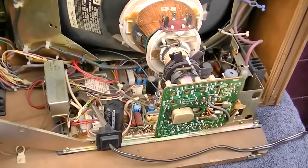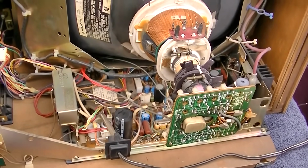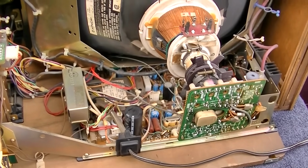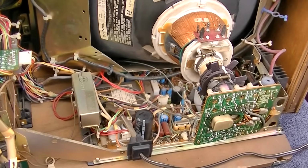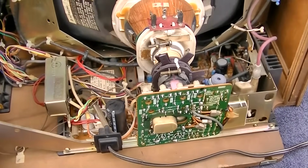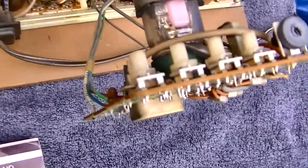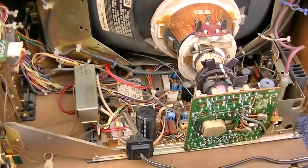It's a beautiful day here at the Vintage TV repair desk. So, as I thought, I had seen this issue before and actually had a video on it, and I'm hoping it's the same thing. I'm hoping for a quick fix. I also ran it by Radio TV Phononut, and he said, yes, most likely an open capacitor in the 200 volt B plus circuit that feeds the transistors right here on this little board. So I guess if you get the horizontal noise unfiltered from the flyback into these CRT driver transistors, the effect you get is the black on one side.